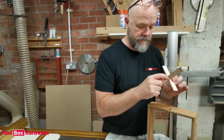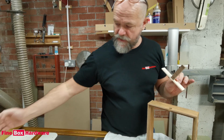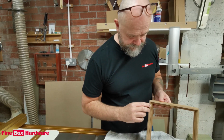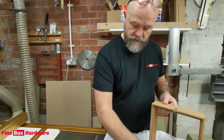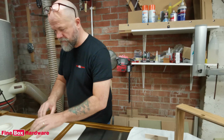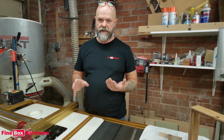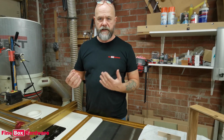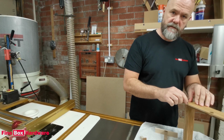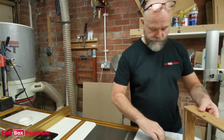But it's important that the distance, that bit of walnut there, equals the distance between your cutter and your fence, okay? Now, I'm going to show you what way I approach my cut. I don't just plow in there, okay? That's going to result in a full depth cut. What I tend to do is lightly plunge it, so that I chip away at the initial part so that I get past the danger zone, so to speak.